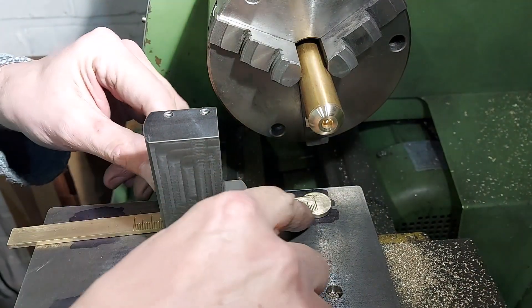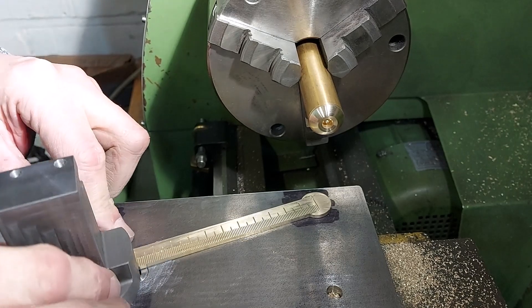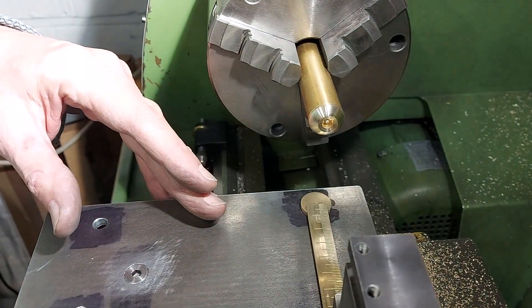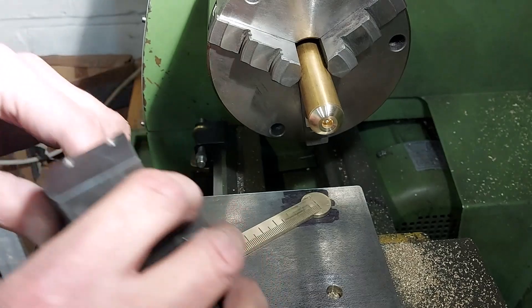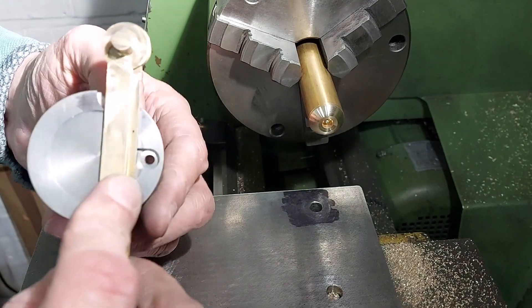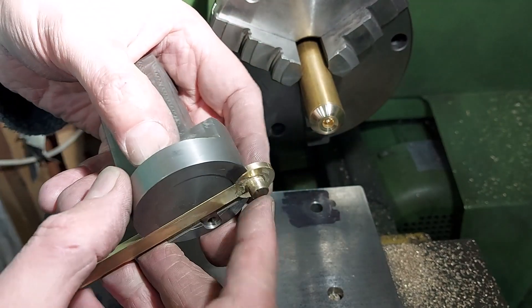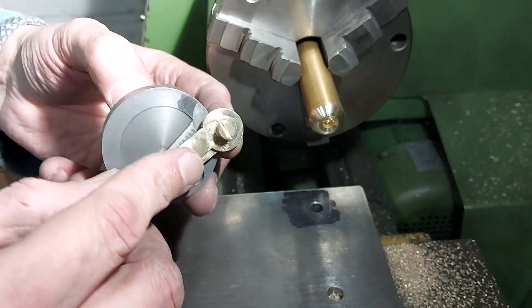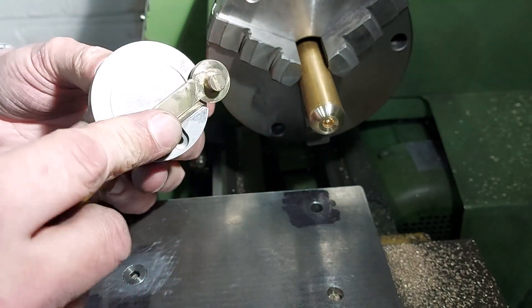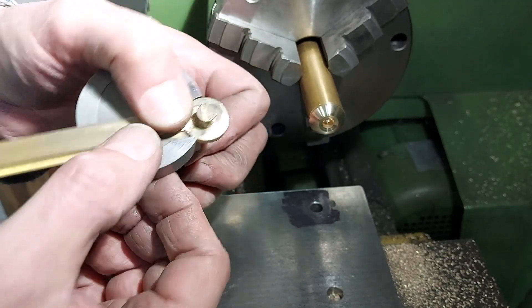I've now got the rule marked out to 110 millimeters radius - that's a huge radius, I can't see myself ever using that, although it might be useful on a piece of steel. The tool holder now has a slot for the rail in the bottom, so the rail fits in there. There's a little indentation so the button that everything rotates on can go in there, allowing me to get down to zero. There's also an indentation in the hole where I'll put a button and bolt to tighten the ruler up.